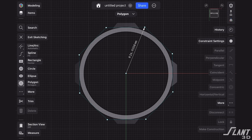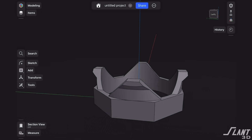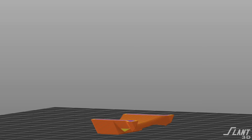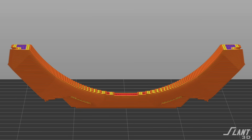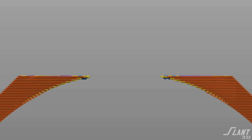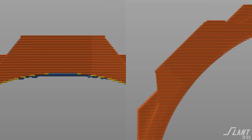Going a little bit further, with those fillets and chamfers when you're printing on its edge you have effectively eliminated the overhangs, and you can take this further by adding an octagonal outer pattern. This is only necessary if the strength of the clips is absolutely critical and you need to maximize that. In this situation you want to print it on its side — that allows all of the layer lines to be in plane with the clips. Make sure the clips are at a 45-degree angle to horizontal, because if you have one on top and one on the bottom they're in a plane where they can break off due to layer delamination. Putting them on the diagonal ensures they're not able to do that.